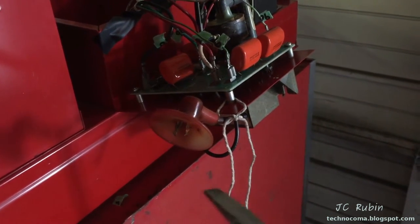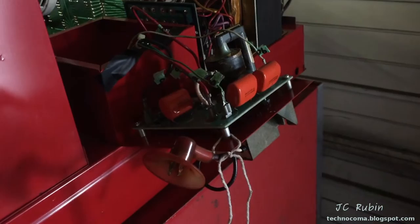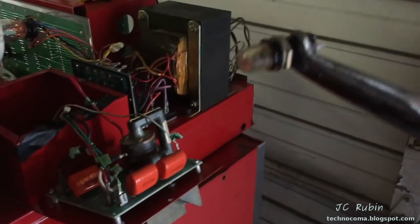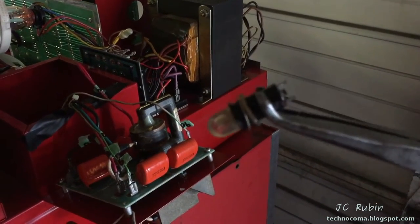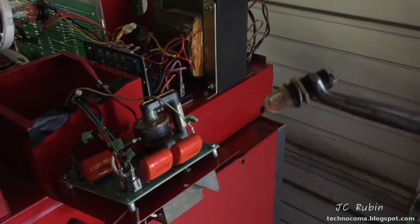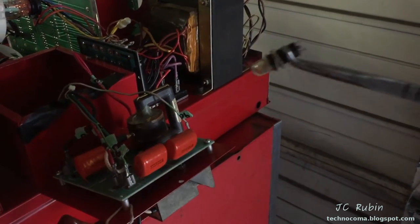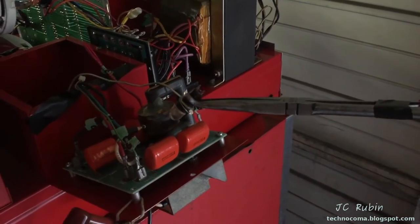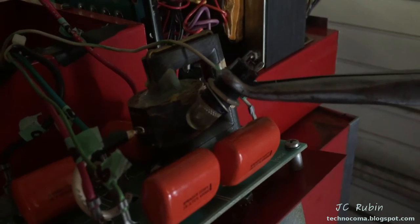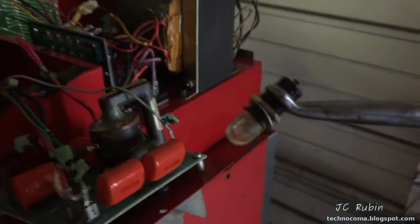The next thing we're going to do is hook the neon bulb around, loosely couple the neon bulb to the flyback transformer, and see what we get. So now we're in a garage that's nice and dark. This is actually a neon bulb in a package — these have been tested beforehand — and I'm going to bring it around the coils of the flyback transformer, which should have sufficient RF to drive this bulb and at least make it glow slightly. And I got nothing. I got absolutely nothing. So now it's time to step back and start checking some voltages, because the flyback is not working either.